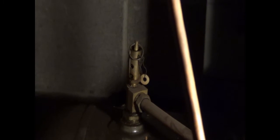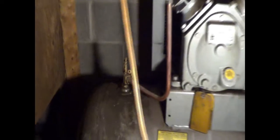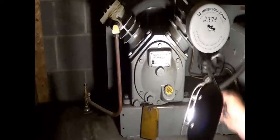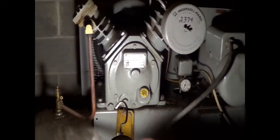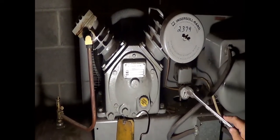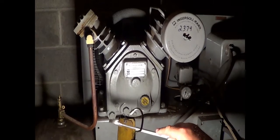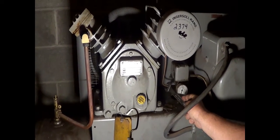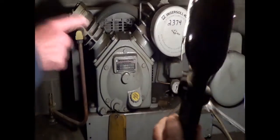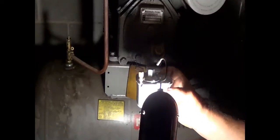You can fix it because you're a mechanic. The other thing I would do is: there's going to be a port on the side of the check valve. I would run a new copper line from right here at this pressure switch to the port on the check valve. That way you unload the entire system — not only do you have a bad check valve, but this isn't the most efficient way to unload the compressor. So when you put your check valve in, run a new line from this unloader on the pressure switch. That copper line goes there — run it over to your check valve.